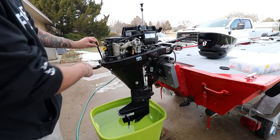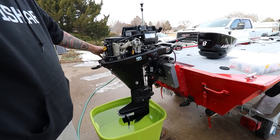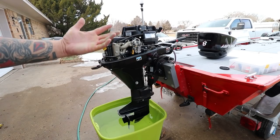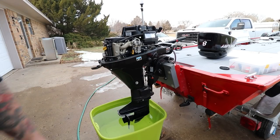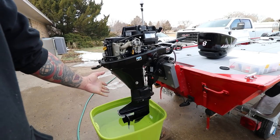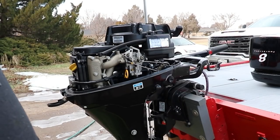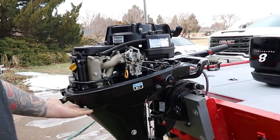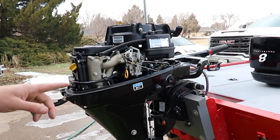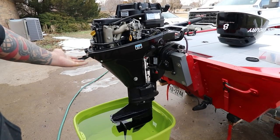I got this hose of the telltale unplugged and I can blow through it and feel the air pressure coming out — so this hose is not stopped up or clogged. That's the easiest solution, so that sucks that it's not that. It may be this vent down here blocked as well. I'm going to take that vent off, look inside there, and see what's up. Maybe even have to take off the propeller. I should have closed off the vents and everything — I'm going to start doing that before I park her for a long time: cover this hole, cover those vents down there, so we don't worry about it getting clogged.